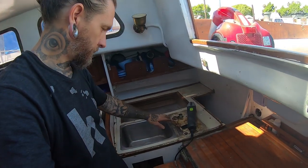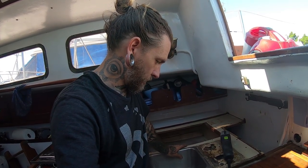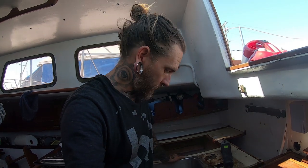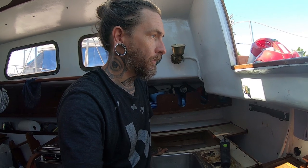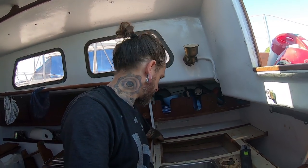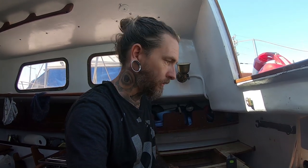Okay, we're at the point where it's time to start making cuts. We've got everything taken off, ripped out the faucet which was fused on — I couldn't get it so I just broke it apart. I'm going to leave the sink attached and take it off once the top is cut free. I'll unhook the hose that goes down to the seacock. Right now we're going to cut this back line that's going to determine our new countertop size. I'm going to follow the furthest back line where the track was, then glass the two together so I'll know exactly where the sliding track has to go on the new countertop.